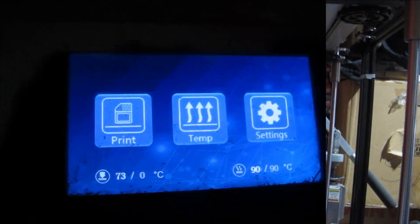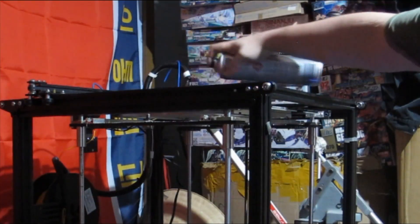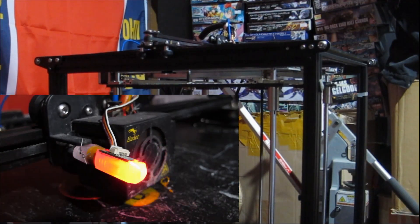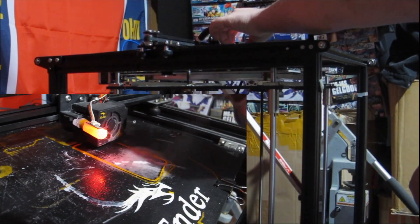The 3D models are well drafted and sliced quite easily. I've put everything on my Creality Ender 5 Plus bed. The printer is a bit old and showing signs of wear, though still produces prints quite well. With the BL Touch no longer working, the process now involves leveling the bed by hand with the Z-axis screws.